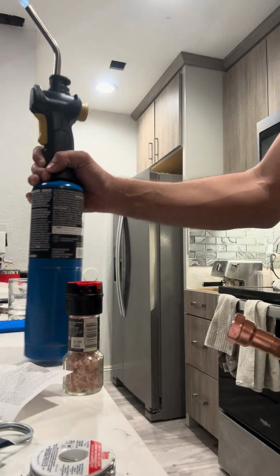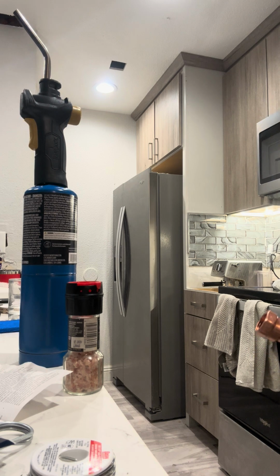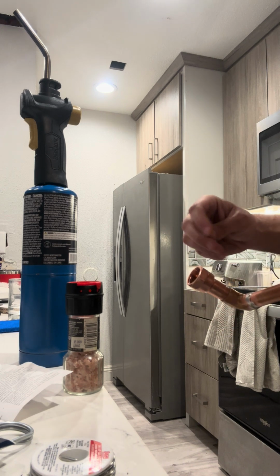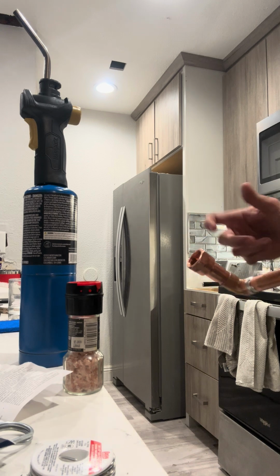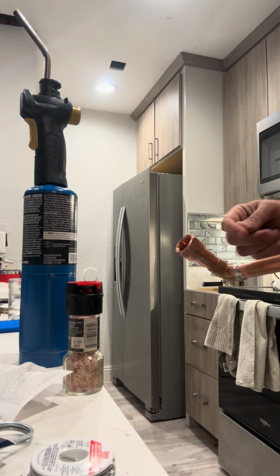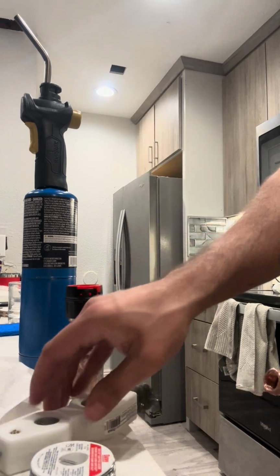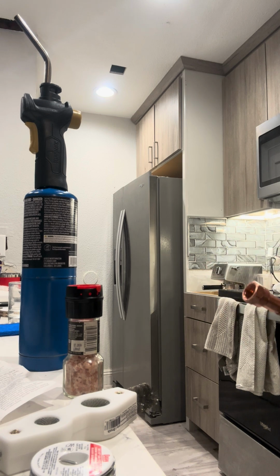Oh, I feel like an idiot, actually. Probably shouldn't be doing this late at night because I am a little tired. I apologize, I did not prepare this well enough yet. I have to make an abrasive cleanse, if you will. Everything kind of has to align. Meaning I have to scratch the surface a little bit with 120 grit paper. In this case, I'd use this thing. I didn't do that yet, and it's probably kind of hot, so I don't feel like doing it right now. I'll just take it off, but you can see that I did that on this side already.